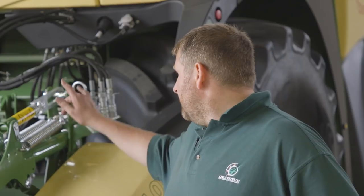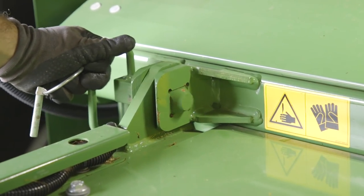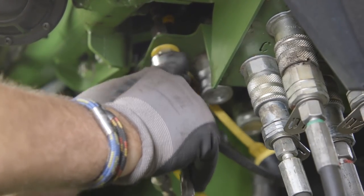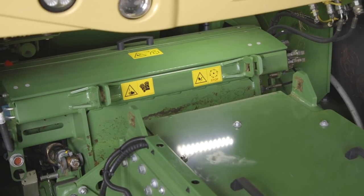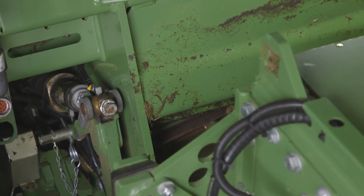We wanted in at the drum because it had now done a little bit of work, so we wanted to double check the torque, to make sure that the bolts and the blades and all were torqued and everything was okay. So two pins up on top there at the back of the feed rollers, pull those pins out, take out another, is it four odd, and one wire over there, we're dropping that down, we can veer out so we can look in from the top down if you wanted to inspect the blades if you're out in the field and had a bit of an issue.